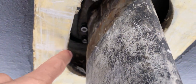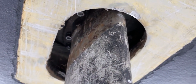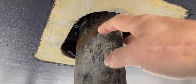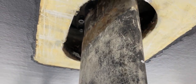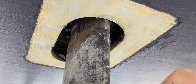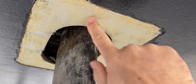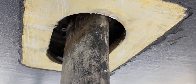You can also see where the fastenings are that attach the sail drive to the underside of the gearbox. Now the Abbott seal is there purely to prevent or slow down marine growth up inside there. You can imagine if this is all covered in barnacles, weed, etc., it's going to make the engineer's job a lot more difficult. So the Abbott seal is slipped over the sail drive and is glued to the hull, and just prevents most stuff getting up there.